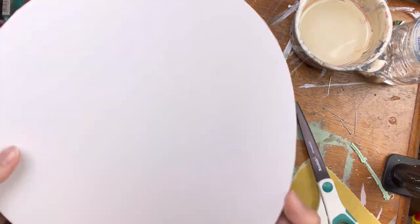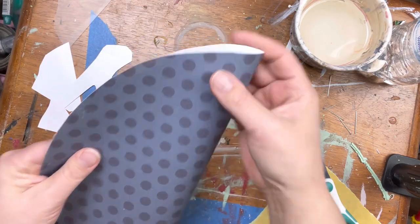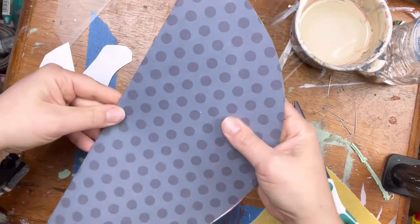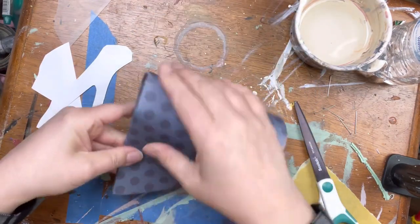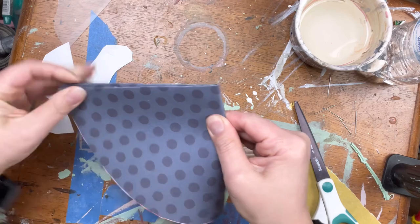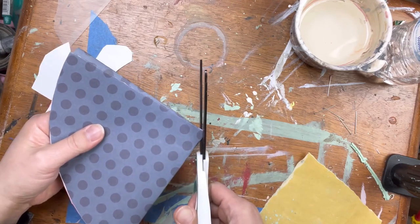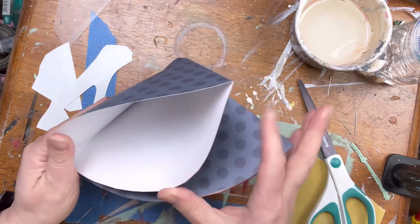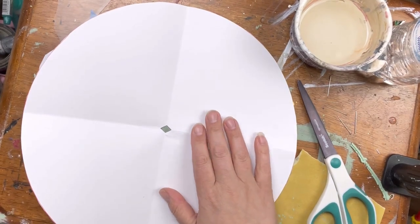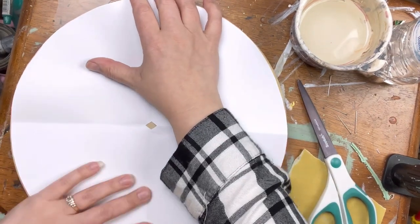The only thing you need to do to find the center of the circle is fold the circle in half, line it up so all the edges meet, and then you're gonna fold it in half again and make a triangle. Make sure those line up nice and even. We've got a little fan here and then you just cut the tip off, and the hole we just made is in the dead center of your project. So we're gonna mark our plate by putting this down, laying that on top, lining up the edges, and marking the center.